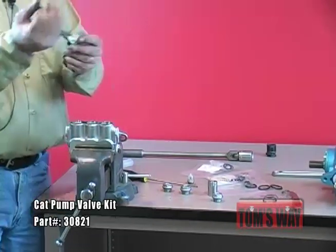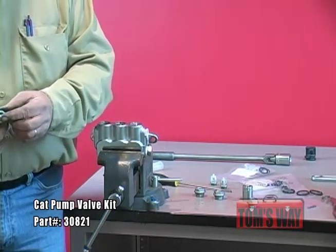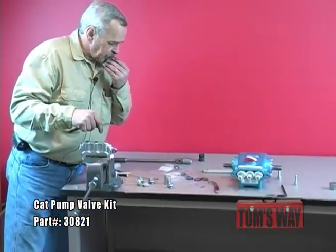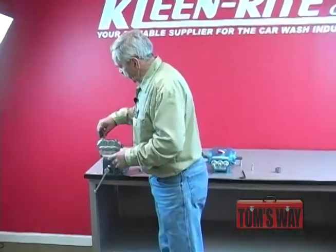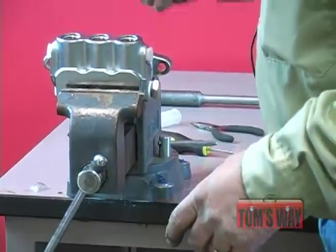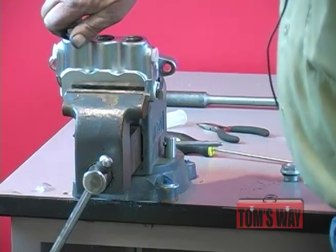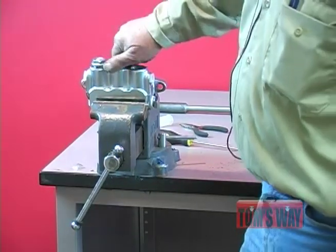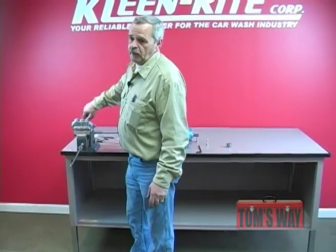All three go in the same way. Use the needle nose pliers — pick up and turn at the same time. Inspect them for dirt. After you've inspected them, make sure you check for washout. You're going to replace the valves back inside the head. They will go down in and start — just pick them up, put them in place, and push them down with your thumb, finger, or screwdriver. Once you've done that, you're just screwing the top back on. Same thing with the O-rings on the caps — when you buy a valve kit, the O-rings come with it. Replace them — good, bad, or indifferent. You've already got them, you've already paid for them, put them on.